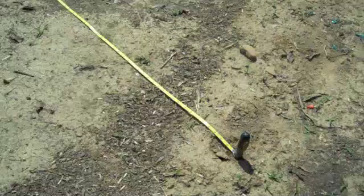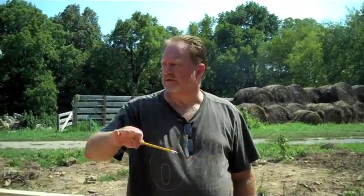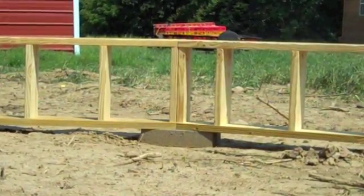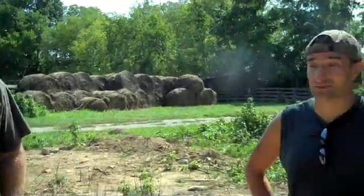Well, I tried to just do a rough grade. We kind of just started with the infamous screwdriver in the middle and laid out where we thought the dome would be going. Then we did a rough grade around with the tractor and grader, then got a little laser level and leveled all the blocks. Over here was one of the deeper ones, about three inches, and a couple of them over here I'd add like an inch or inch and a half. I felt like we'd have a pretty level base to start working with.